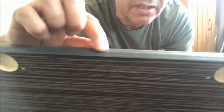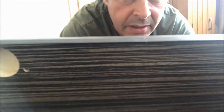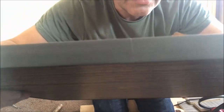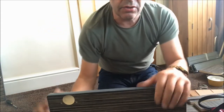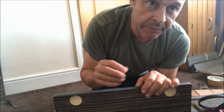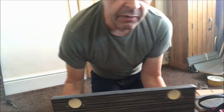And there you go — it's nearly invisible. You can see there's the edge and it's pretty much invisible. It's a perfect join. Just make sure when you get the knife it's as vertical as you can, and just chop down through both bits of edge trim into the bottom one, knock it in, and yeah — that's pretty perfect.